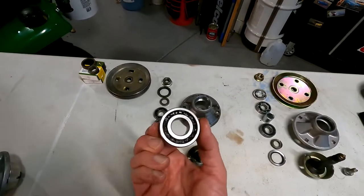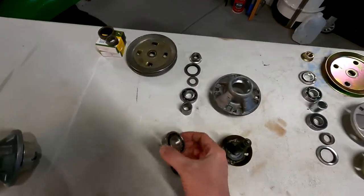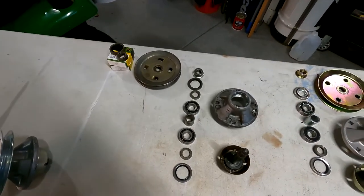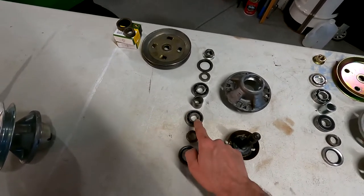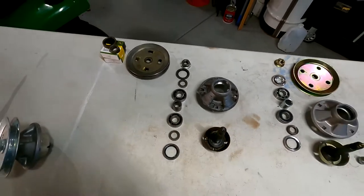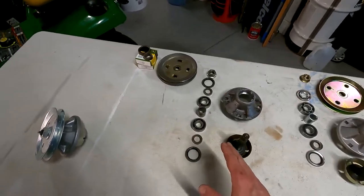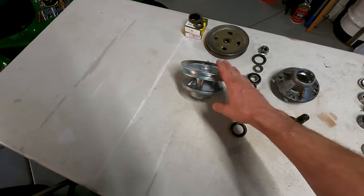I can find a C3 version for about $10, and if you get a quality one and don't do a lot of mowing, you might be okay — that cuts the rebuild cost almost in half. But no matter where I go — Deere, Timken, wherever — a 6204C4 runs about $20 to $25. So you might as well go to your John Deere dealer and get their stuff to rebuild it. Or, if you're not into rebuilding, save yourself the headache and just get the new OEM spindle.